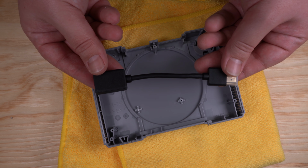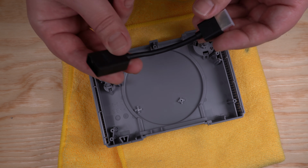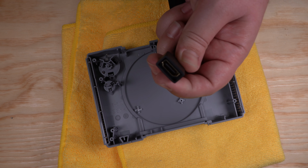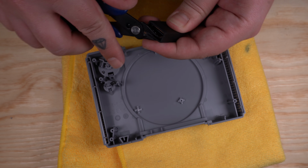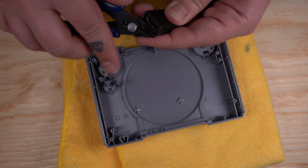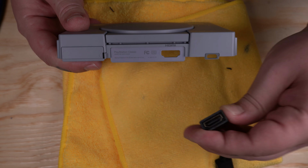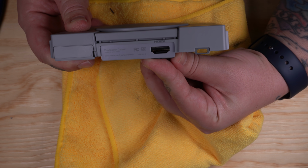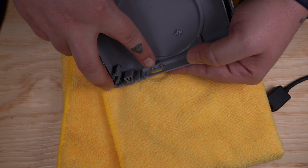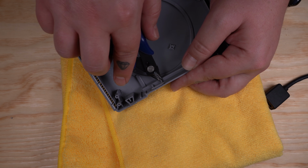So let's go ahead and get our new HDMI port installed. I got this adapter on Amazon and I'll go ahead and include a link in the description for it. It's the perfect size for this project. It's got a little bit of a lip on it, so we're just gonna trim it off real quick. And you'll notice when you try to fit it, it doesn't quite fit. That's because of these two plastic tabs in the way. So we're just gonna go ahead and cut them out.